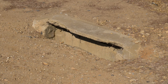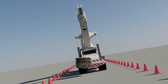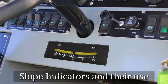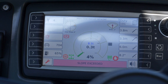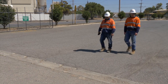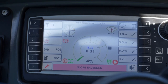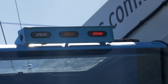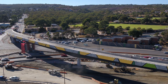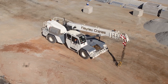If a front wheel of the crane was to drop into a pothole or off the verge of the road, this will have the same effect as working on a slope — the crane can go from being stable to tipping in an instant, and the operator would have no time to correct the action. Slope indicators may be fitted to your crane, ranging from a simple bubble angle indicator to an electronic cutout device that prevents the crane from operating if it is at an angle greater than the load chart allows. Use the side slope indicator to help determine the slope of the ground, and pre-drive the intended path with no load on the hook, noting any gradual change in slope that might give a sudden change to the crane's angle when travelling.